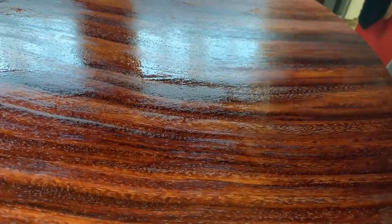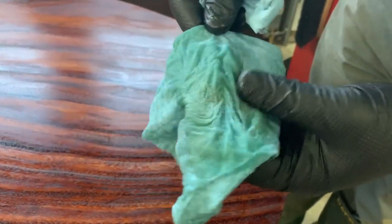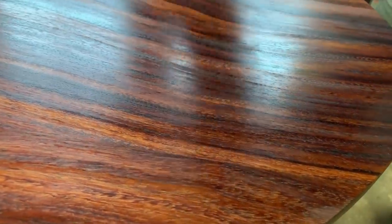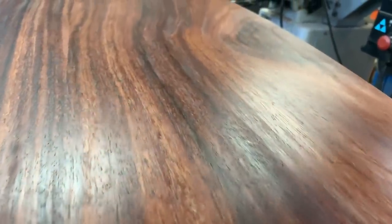I've applied three coats now and let it dry for four days between coats. The way I know it's dry is not because the surface feels dry — it feels dry as soon as I finish wiping. The rag I use is a great indicator: for a couple of days after applying, it hasn't dried appreciably. Unless it's dried on the surface, you're not going to be able to build anything in the pores of the wood — not that you want a film, but you do want all the pores saturated. I'm wiping off this fourth coat now, not with full force — there's a tiny bit left on the surface, but that's essentially it.